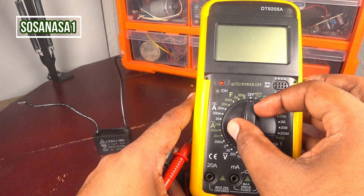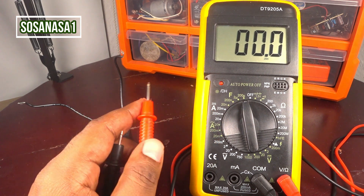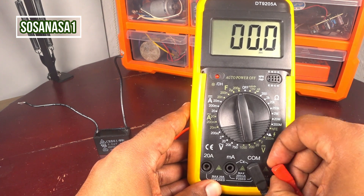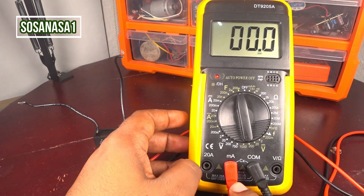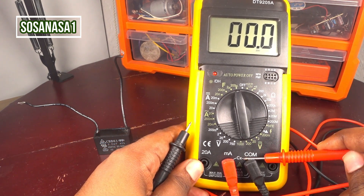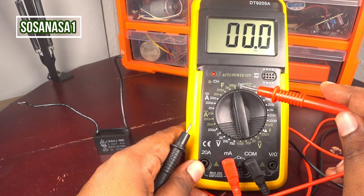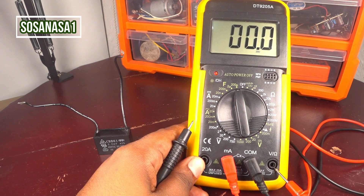The first step is to choose here 200 microfarads. In this case, it is the same number that we are watching on the screen. Now, the second step is to change this cable from this point to this point. If you watch here, this CX, it means capacitor mode. And if you look, I need to connect this and this to measure Farad in this mode. That's the reason that I change this from this to this point.